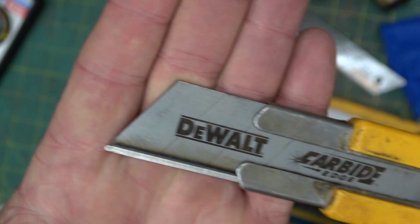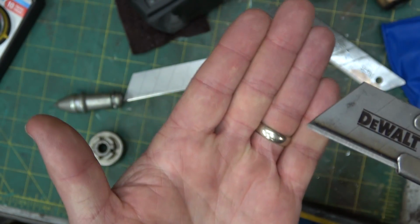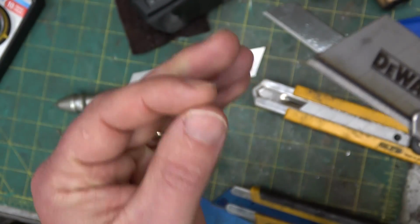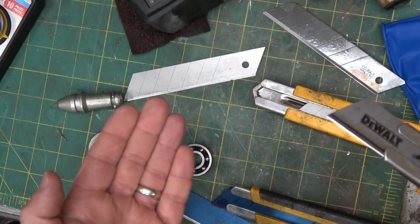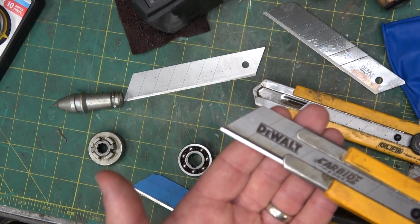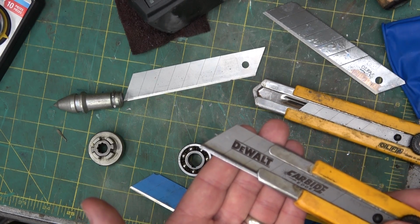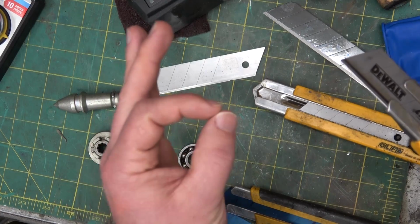Now, initially my thinking was that the carbide would be good, one, because it's very hard, but also the fact that they need to grind carbide with diamond. You'll notice this: if you buy high-speed steel tools from the usual scumbags, all the way from Mal's Dollarama, the Big Rock Candy Mountain, the high-speed steel will be complete and utter shite. And the carbide, beautiful specimens. Why is that? The secret is in the grinding.